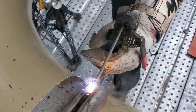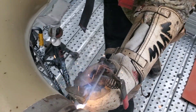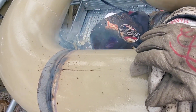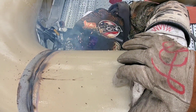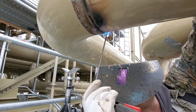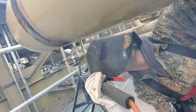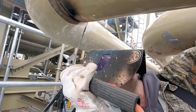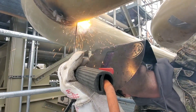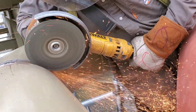Putting the fire in the pipe — don't want too much coming out because it ain't gonna work for you. I already dropped down and was able to get it with my right hand. Sometimes the tie-in won't go the way you'd like it. I didn't like it so I had to grind it and then go back through it — it just happens. You've got to make sure that you're getting 100% penetration in there, because if not you're catching a repair. I don't want a repair.